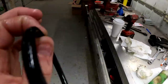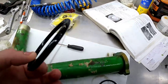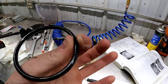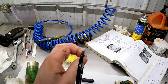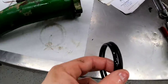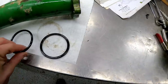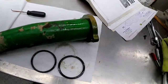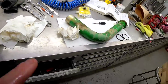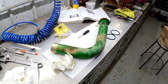Here's the O-ring that was up in the tractor. It doesn't look too bad, so I'm wondering why it was leaking — I don't know if it was just not seated well or what. It's still got some spring to it. One is a lot flatter than the other. But where Nathan said it was leaking was this one, which is the better of the two. So let's hope both new O-rings fix it. But the buckets are filling up quick, so I'm going to put some Vaseline on the end of that pipe and get it in place before I have more full buckets and no more room to put the oil.